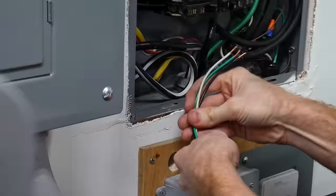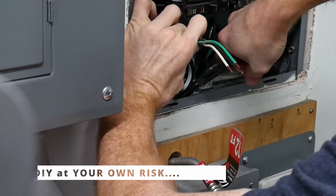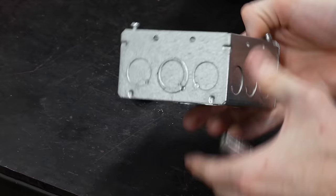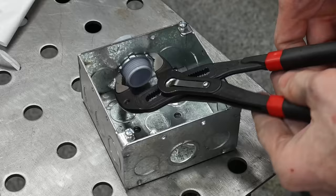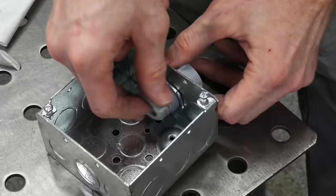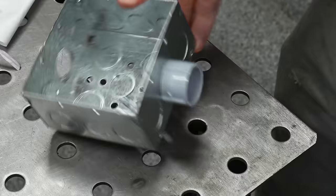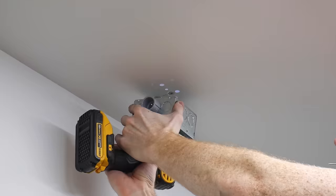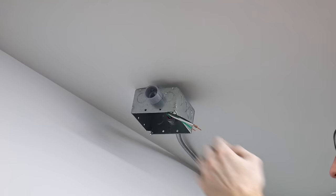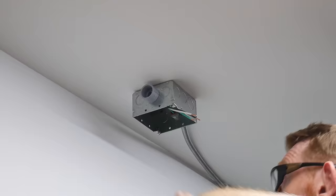Step one of this process is going to be the wiring. I want to note that I am NOT an electrician and any project you decide to take on in your own shop is at your own risk — electricity will kill you. I decided to use MC armored cable to connect to my main breaker box, since this negated the need to fit conduit connections behind my drywall. This cable is American wire gauge number 12 and I wired it to a 20 amp dedicated breaker. The mini split I ordered was the largest 110-volt version I was able to find online at 12,000 BTUs.